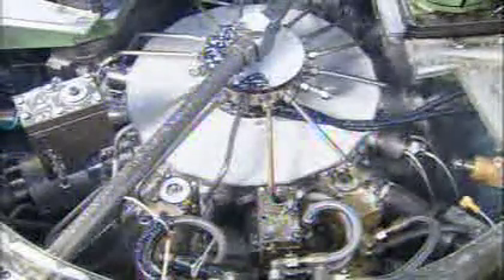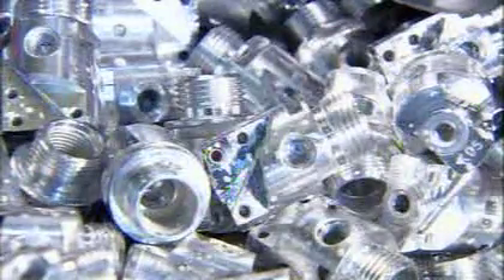To make the release valve, they start with cylindrical pieces of aluminum called blanks. A carousel runs each one through 16 different machining stations. At each stop, under a shower of lubricant, tools shape the blank for 6½ seconds. As each blank completes the circuit, it comes off the carousel — from blank to valve in a minute and a quarter.